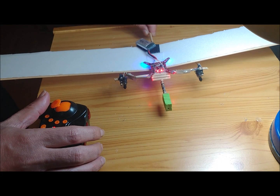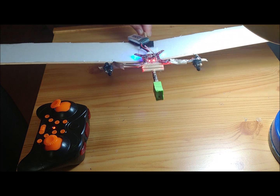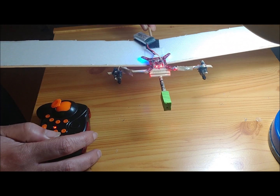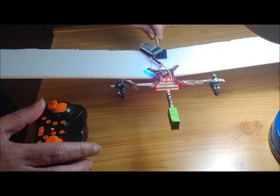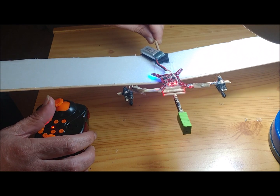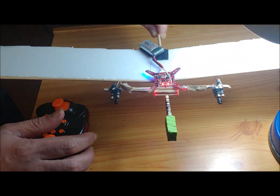In the next version, the motors have been placed in the front of the drone board and the third motor has been removed. In this way, the motors decrease in power when the nose of the aircraft raises up. The arm of the motors has been increased to 5 cm so that the turning moment in the yaw axis is greater than in the first version. With this, we hoped to fix the problems for turning to the left. It is noted that the behavior is now much more nervous, and the gyroscope stabilizes the plane very abruptly. In the test, we note that the plane is constantly spinning.